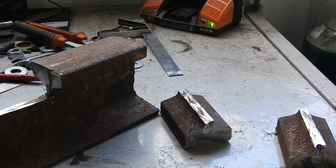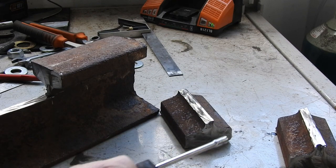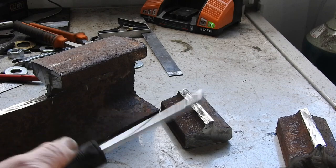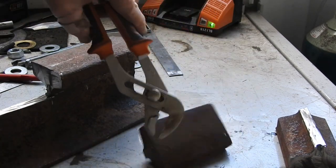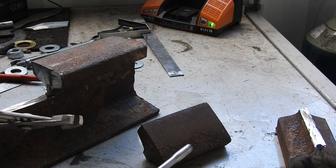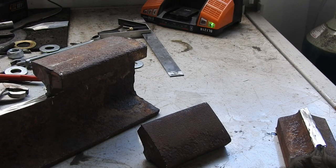Here's what's going to be the beginning of the first set of dies from the hammer, and it's from an old piece of railway track — slight curve on the top. So I've cut these off — I can't touch it because it's hot — just did it with a thin grinding disc. Cut them off, flatten all that out, and then weld on some tangs so it can be bolted to the hammer itself. This will be the first set of dies that I'll use. We're making do with some old railway line.